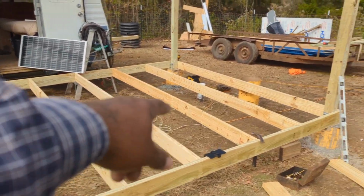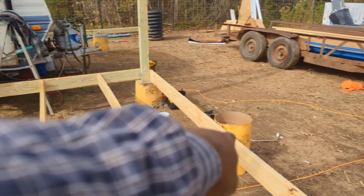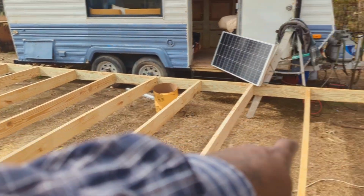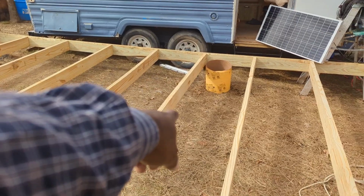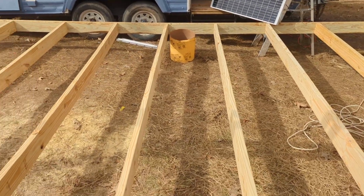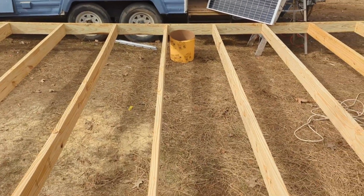After I dig these two footers, this one here and that one down there, I'm gonna dig low enough to fit a 2x6 underneath the floor here. It's gonna be a 10-footer going there, and then a 10-footer going there. And I need to find another way to attach a footer there. I might have to use a cinder block, concrete in some cinder block right there, and dig a footer down in there. But I got a couple pieces of cinder block I could use for that.